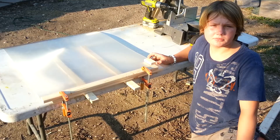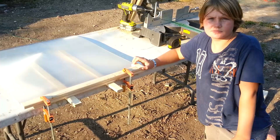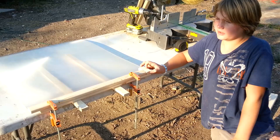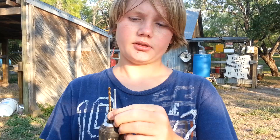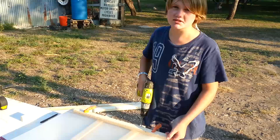We're putting the lens between the frame boards, with them staggered 1 and a half inches from the end. I'm using a wood block to measure how far they're staggered and using wood clamps to hold them together until I can attach them. My drill bit is slightly bigger than my bolt. We'll be putting three holes on this end, but not on the very ends where they overlap.